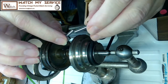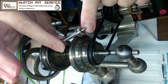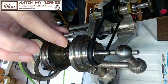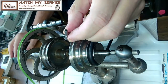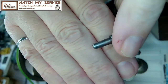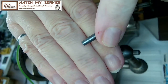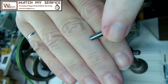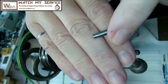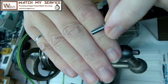I've just discovered something with this little dog — it actually comes out! I was worried it was attached permanently, but it comes out, so I can find a collet for the cutting part as well. It's also slightly tapered, so I could just jam it into the end of the tailstock without needing a collet-holding tailstock — but I do have one, so I'll hold it with a collet.